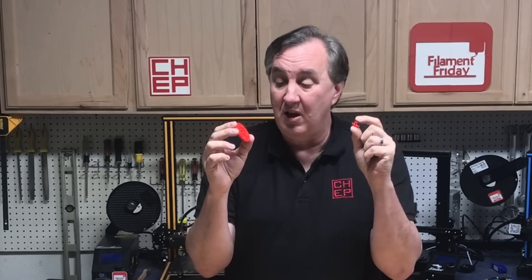So if I need better prints than this, I'd probably go with one of those low-cost resin printers — you can get one for about three or four hundred dollars and it'll print a lot better. But for most jobs where I need to print a little gear, a little knob, or some fine detail, a 0.4 nozzle with that thin wall setting should cover about 90% of what I need.